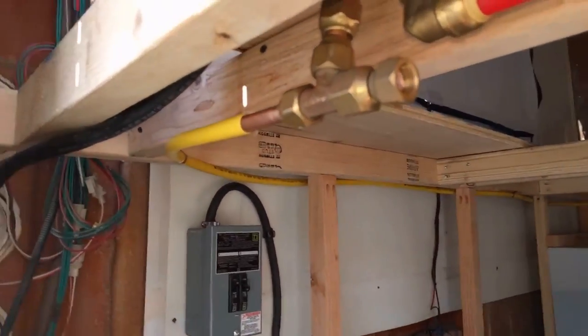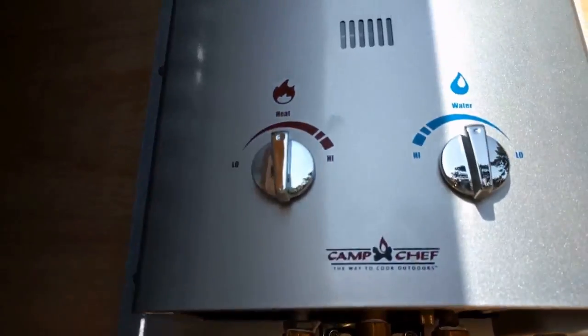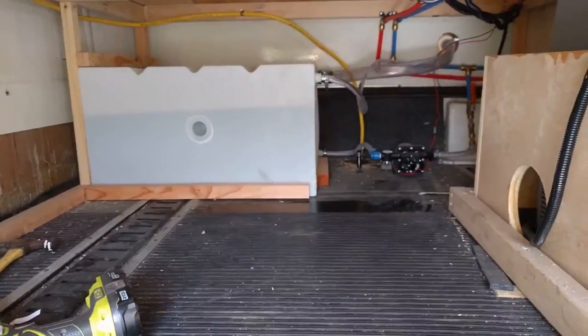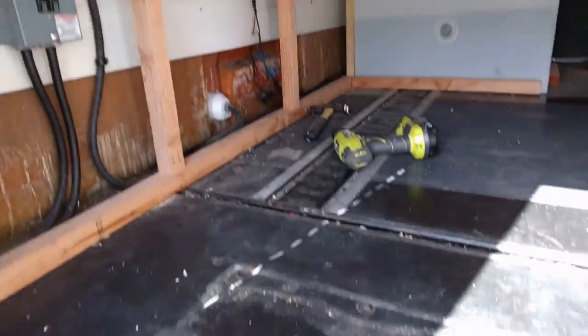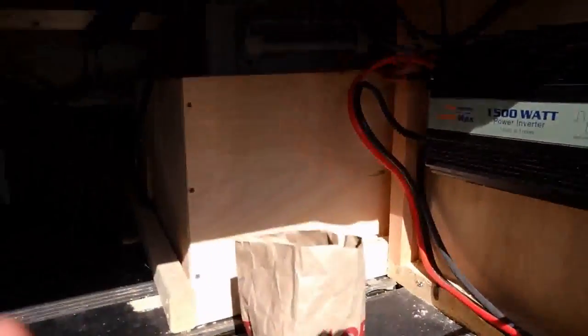They're doing a great job. They've got the T in there. I've got it hooked up here to the water heater. And that's a half inch line that runs all the way around there. It goes down and into the floor and down to the tank. And right now we're getting ready to hook the three-eighths inch line in right there. And it's running here and behind the cabinet over to the stove, but this will all get tucked up in here, get it out of the way.